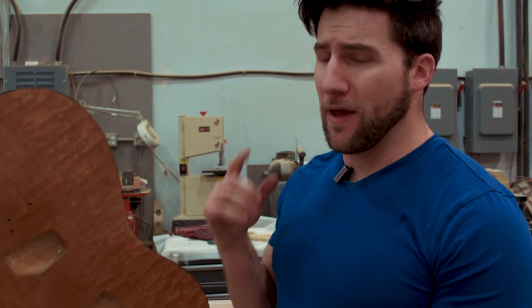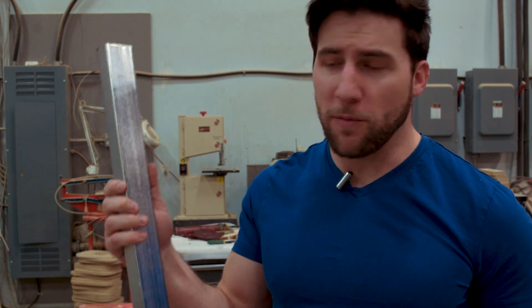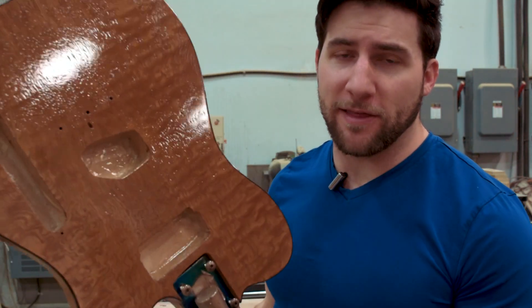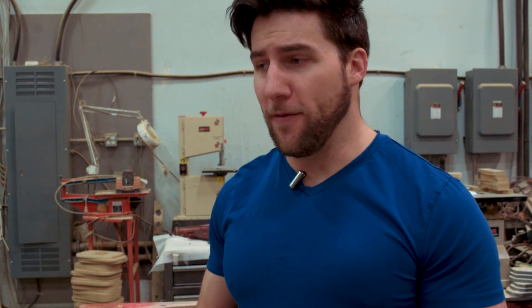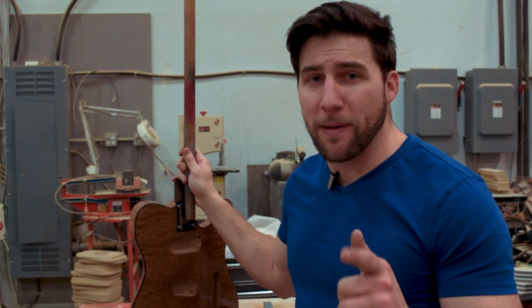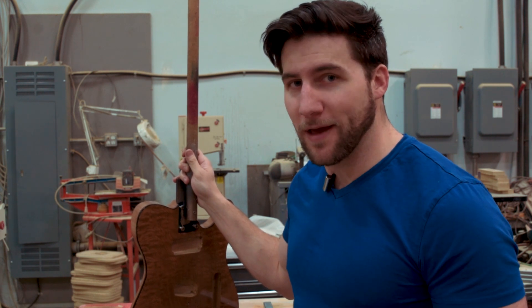We're going to call it a day for this video. In the next one, I'm going to show you how you can take one of these leveling beams from Solo Music Gear — which are awesome, great for fretwork — but I'm going to show you how to use it to do flat sanding on this properly. It's going to make things a lot easier. Then we're going to add a few more coats, let it dry, and then it'll be time to polish. We'll probably try to get through most of that in the next video, and after that it's just final assembly and we'll be good to go. As always guys, I hope you enjoyed the video. If you did, please give it a thumbs up. Remember to subscribe so you can see the rest of this series, and thanks for watching. Have a good one.